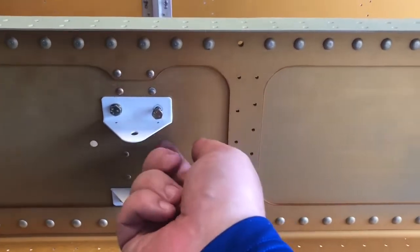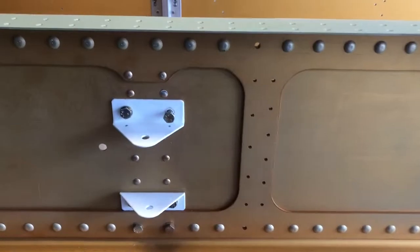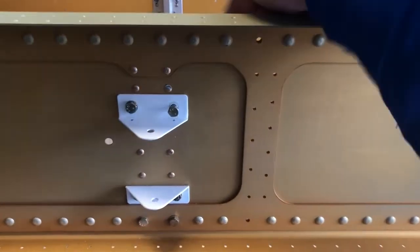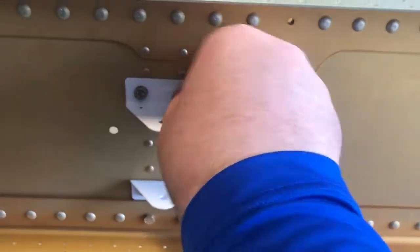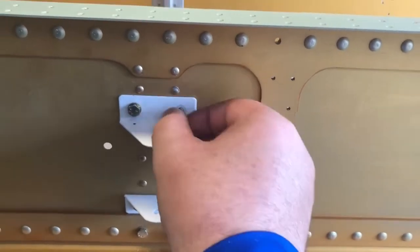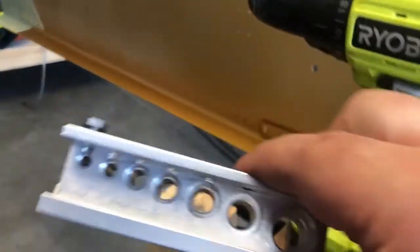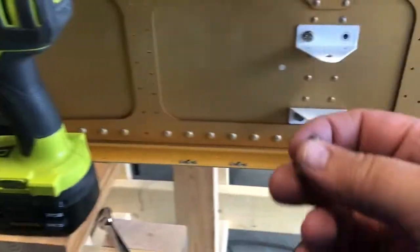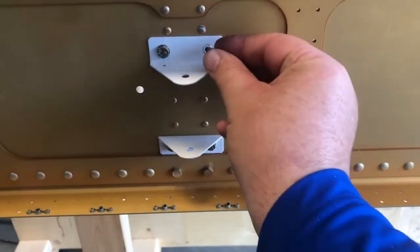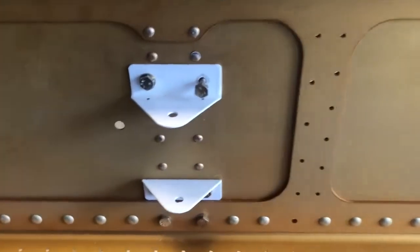When you have a single bolt, you drill a hole in the part itself and tie the safety wire through that. The jig is made by Quantum — it's specifically for aircraft safety wire applications. I'll torque the bolts and run the safety wire once I'm ready, and I'll show you what that looks like.